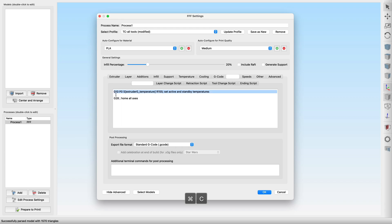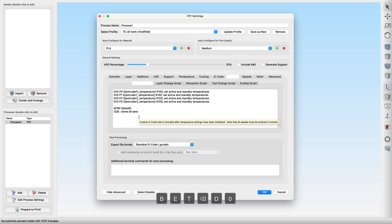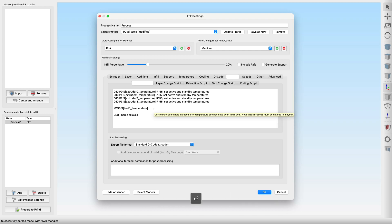Let's set a basic standby temperature with the R parameter and write down a nice comment to this command. We copy the complete line once for each of the four tools and adjust the identifiers to match our settings from before. Notice that the temperature variables have the identifiers we set for the corresponding tool, the same as the P parameter. We still need to set the temperature for the heated bed, home the machine and eventually use the automatic mesh bed leveling.